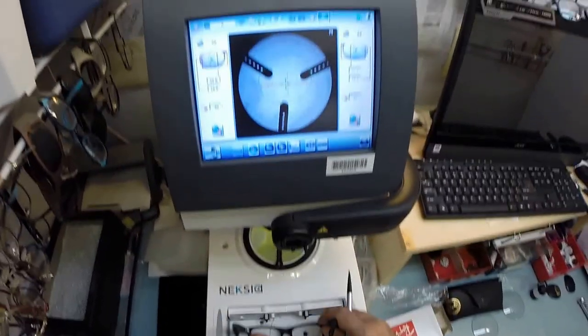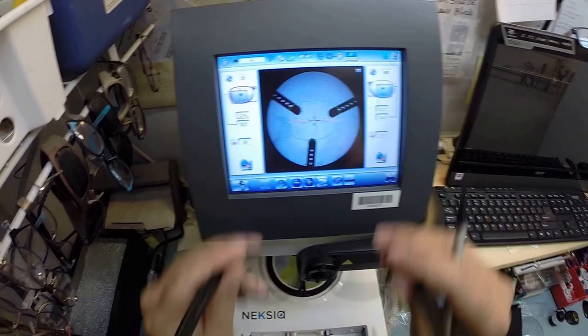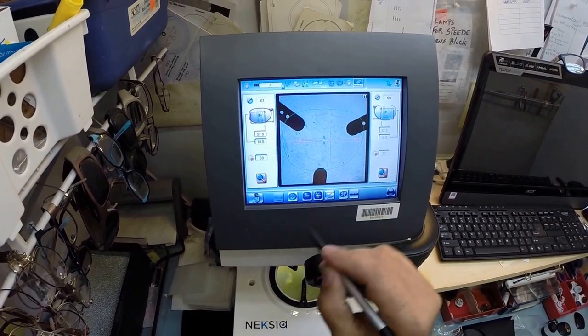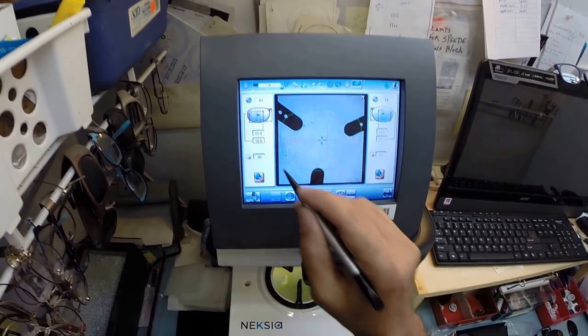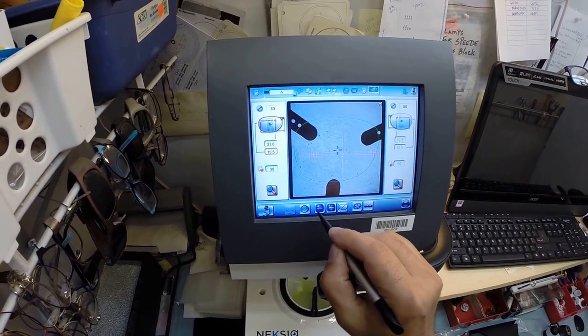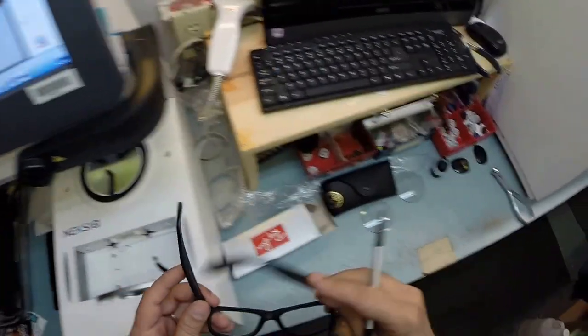That is the shape of your lens magnified. I'm just going to minify it down. That green outline is the shape of the lens I will be cutting. I'm going to go ahead and magnify that for now. Do one setting on there for now too. I also do want to do one more thing here. Let's go ahead and bring that down to 15. This is a line style bifocal. I'm going to put up that grid.